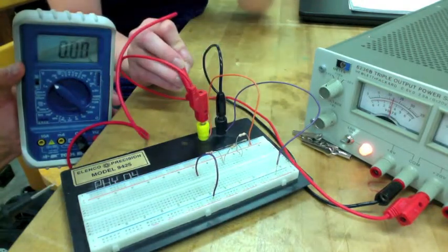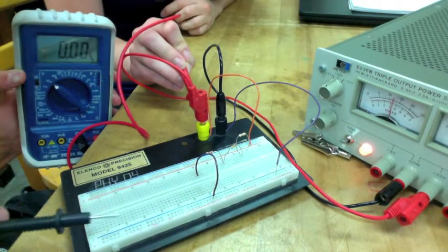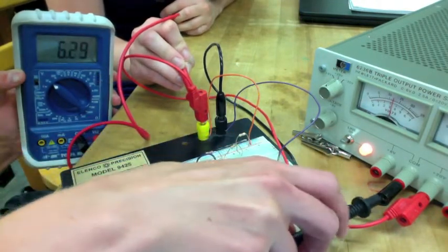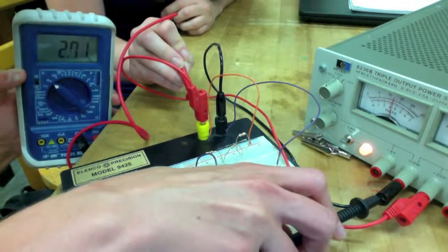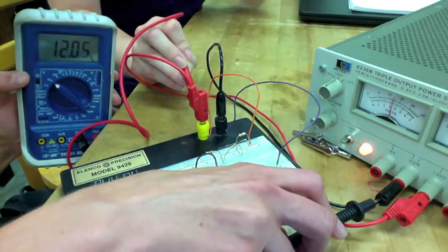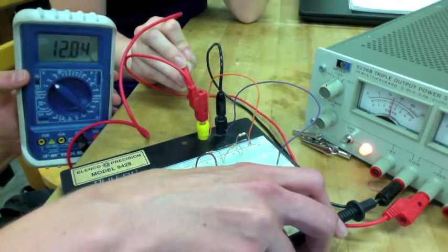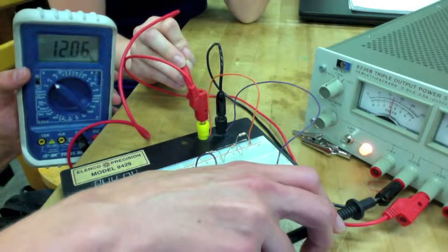Okay, here is our circuit that we made. It has 3 resistors, and if we measure from ground, there we can see that our power supply is set to 12 volts, and each of our resistors is 1K. So we believe that because there are 3 resistors in series, the 3 resistors will take equal amounts of the voltage potential.